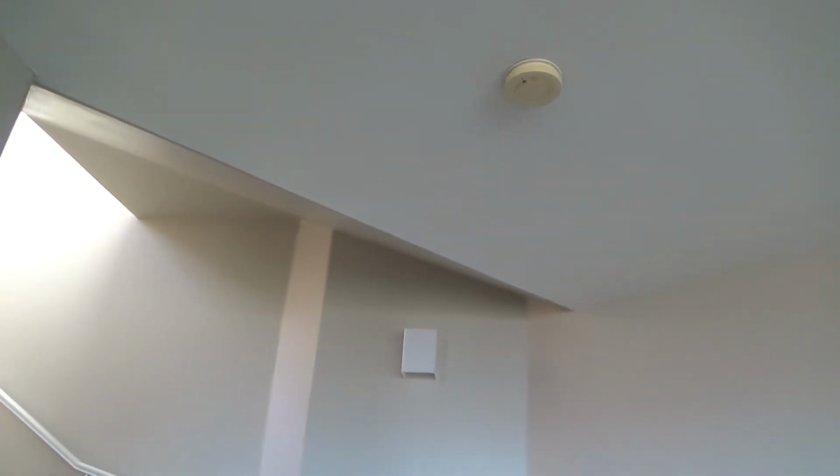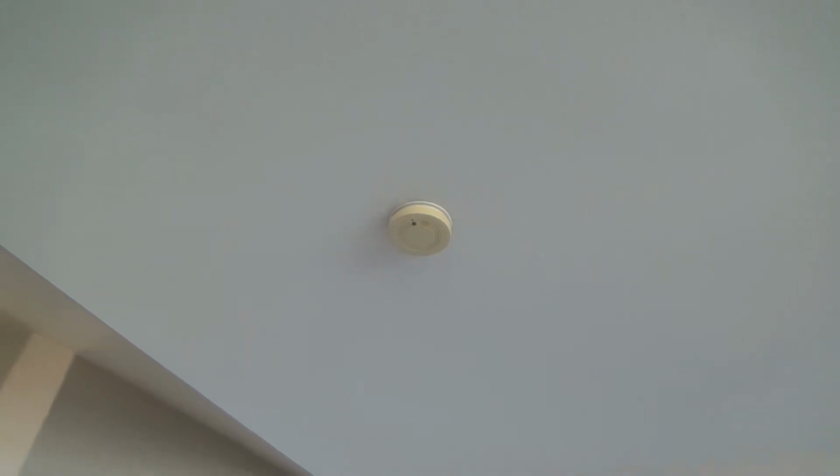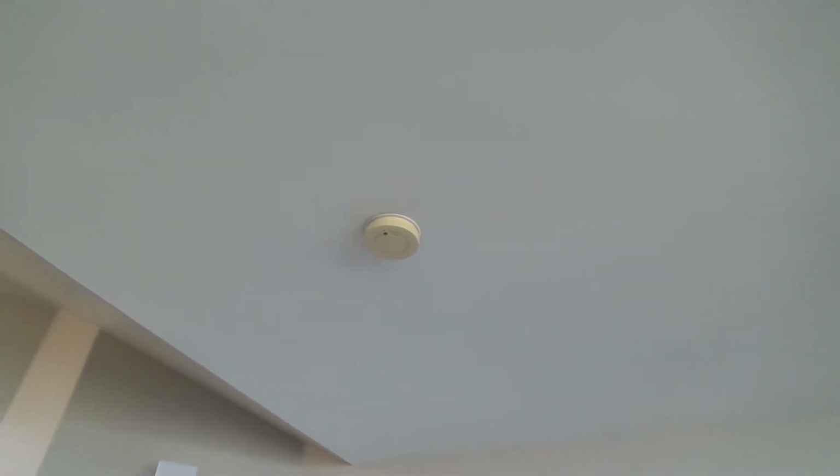Now I've got a 2-story house here, and once I do the smoke alarms down here, I'm going to have to check and not make the assumption that the other ones upstairs are turned off. I'm going to look at the lights and go through the whole process, and they might be on a separate breaker. So look for that in your electrical panel. Sometimes they're not even listed as smoke alarm for that circuit. It might be underneath something else, a lighting circuit or something. You're going to have to look through your electrical panel and flip a breaker, come back out and look.